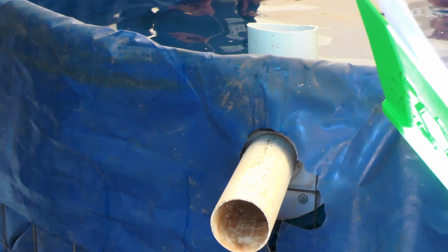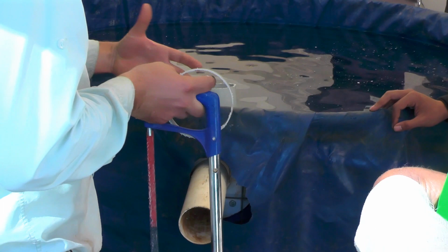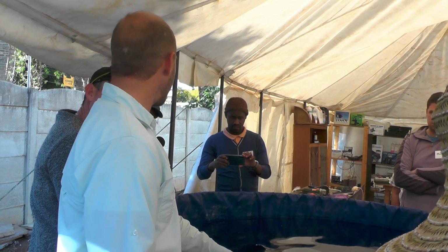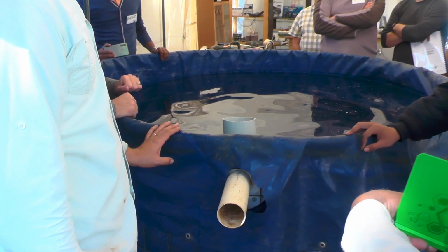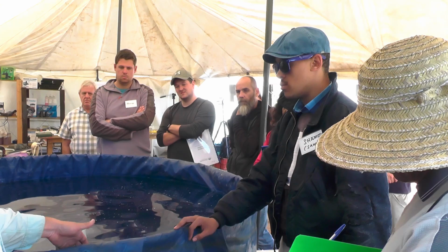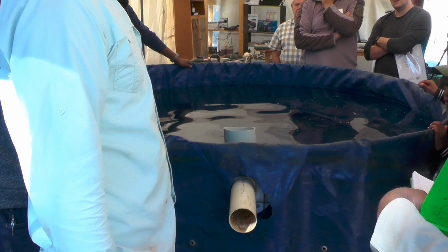Oh, easily. But when you glue it, it will waterproof it. You just use marine glue. The issue with a lot of tank connectors is when you twist them in, it actually weakens the tank. So gluing it and bolting it is a much stronger method, and the surface area you use is much better than the ones you buy that are tiny. It's a very easy way, and you can use liner, plastic, anything like that. If you can't find the actual PVC sheets, you get 110 mil pipe, you heat it and push it flat, like what we did with the end caps, where you flatten it and then you make your flange. Okay, cool. So let's split up into teams.